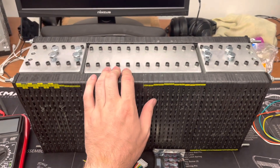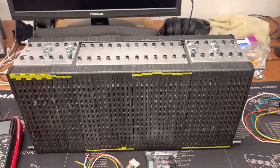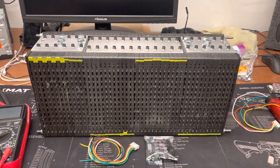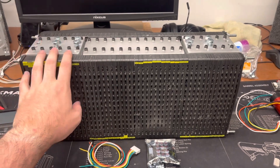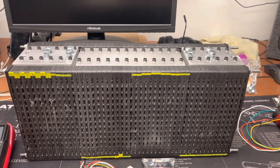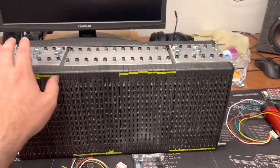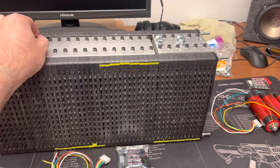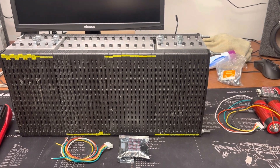I made this myself. Took way too long. I will buy bars next time - I will not make my own. It was like a six hour process, from measuring all the cells and averaging out the distances and everything. The stock bars are like an eighth of an inch thick. Measuring those, scoring all of these, pilot holes, final sizes, tapping, and then deburring all of them on both sides of all the bars. It's like over 200 holes.